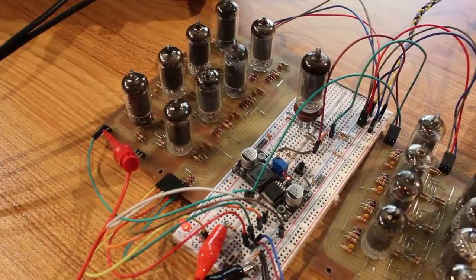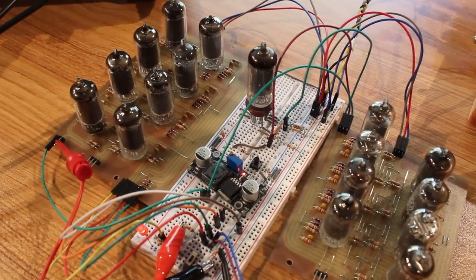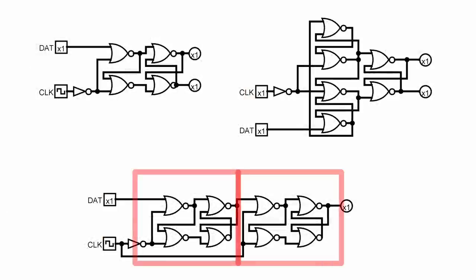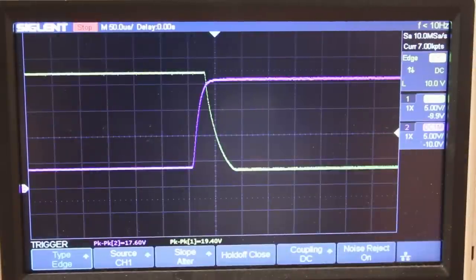So in the previous episodes, we built up the arithmetic unit and we built up the logic unit, and tried to start thinking about how we're going to combine them together. And then we also tested their interaction with the results register. And the results register is a pretty unique results register. It's a master slave D flip-flop or a primary secondary D flip-flop. And we did that because we needed it to change on the falling edge. And in the previous episode, it seemed like that was all working pretty well.